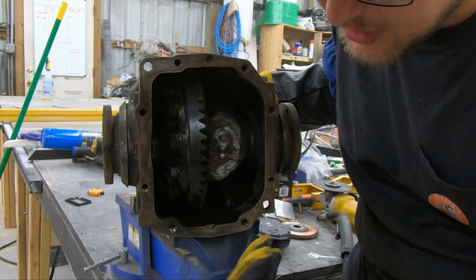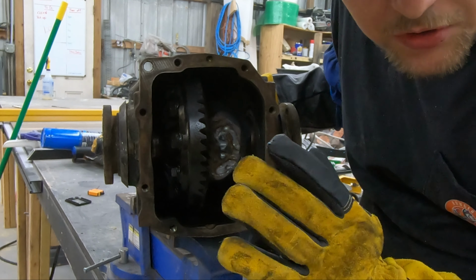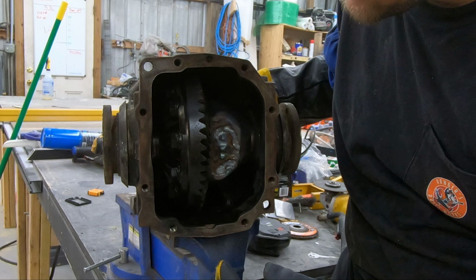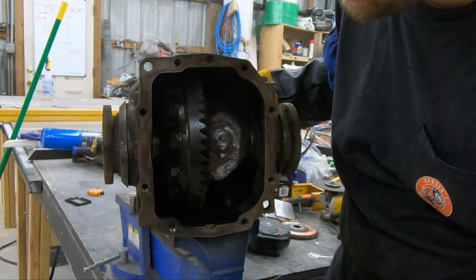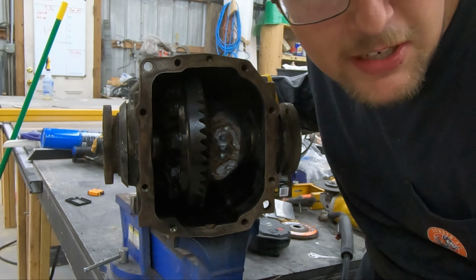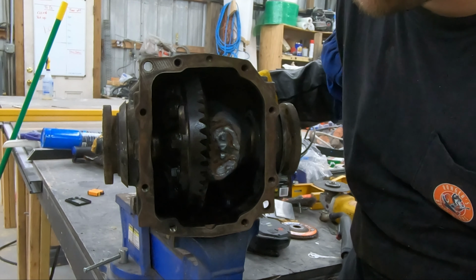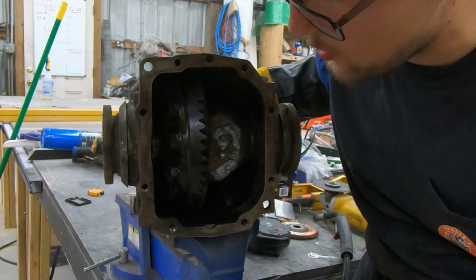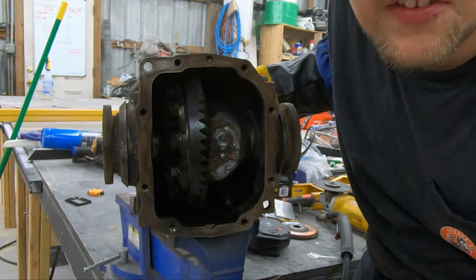You just got a little bit of slag to clean out in the bottom with some brake cleaner once it's cooled down and won't catch fire. Once that's done, clean your cover off, put some gasket maker on, fill it with fluid, you're ready to drift. This is rock solid. I've done it on 20 plus cars, some seeing like 800 horsepower. Yet to have one break on me doing it this way.